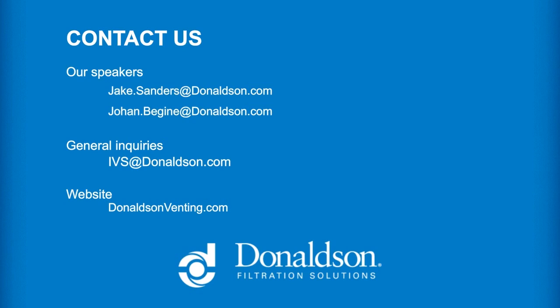Thank you very much. The next question is, what are the installation requirements for your vent? So we do have installation guidelines which can be shared. There's nothing too unusual about our installation requirements. We need a clean flat surface to integrate with the O-ring, and we have specific dimensions and dimensional tolerances required for the snap or thread fitting. But we share full details. In discussions with our customers, we share full details and we guide our customers to make sure that the right installation guidelines are followed.